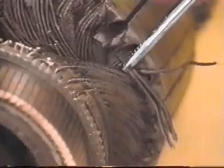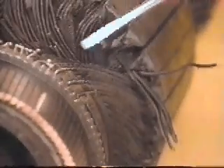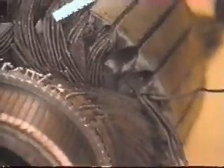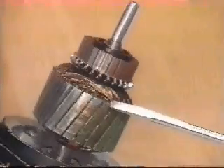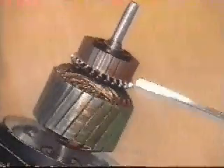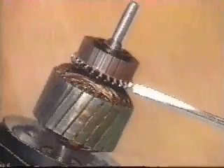Though this motor appears different, its design is identical. The windings run in slots in the rotor, each strand coated with enamel, and each slot lined with an insulated sleeve to protect the coated wires from the metal walls. Note the individual laminates that form the rotor. On this smaller rotor, they're angled or skewed. This permits the motor to run smoother, but at the cost of torque.